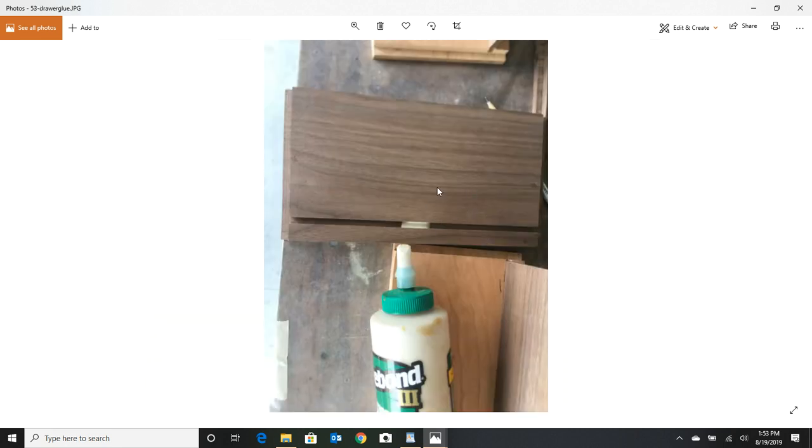Here's a little tip: when you glue in the veneer for your drawer bottoms, since the veneer is running left to right in the slot — four inch piece on each side — that's the direction the lumber is going to want to grow and shrink during the season. Just put a little bit of glue in the middle, because the corners are going to hold the drawer together with glue and pin nailing. A little glue in the middle is all you want — that way the board can shrink and grow through the seasons without splitting. If you have too much glue, it's going to split your wood.